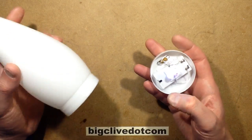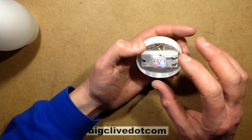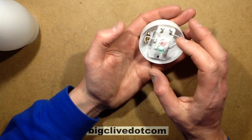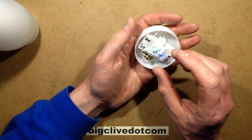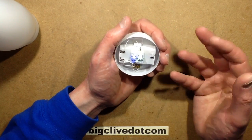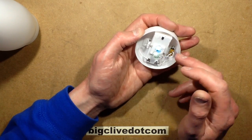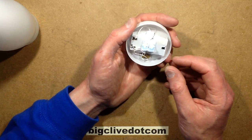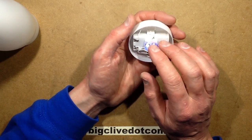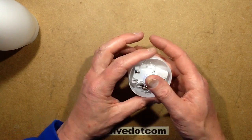The inside is very simple - really just those two LEDs, a switch and the battery connector. It does a really good job of diffusing the light. The choice of just two triple-A cells is not that great because the blue and green chips in these color-changing LEDs tend to require about 2.5 to 3 volts to run at full brightness, whereas the red chip will run way down to about 2 volts. As a result, the blue and green will gradually get dimmer and dimmer, but the red will become the dominant color and take over.